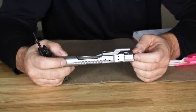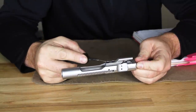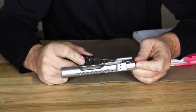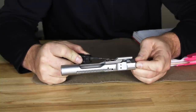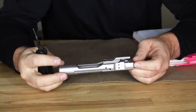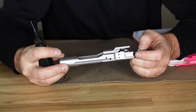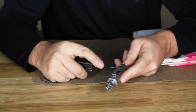As long as carrier key screws are put on properly, it's not. And in this case, where you're using a high temperature Loctite and 50 to 58 inch pounds, this is not going to come loose. Unfortunately, if you were to try staking this because of the hard chrome, you'd end up cracking instead of bending in like the softer metal of the regular carrier key screws. And so I'm not concerned at all about this one not being staked, because it's not necessary. It's mil spec, but as long as it's done right, it's not necessary. So we're taking a look at this bolt.